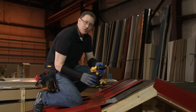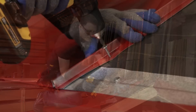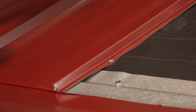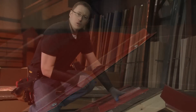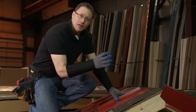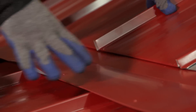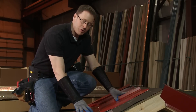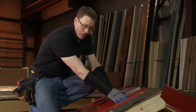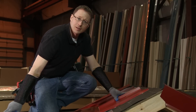I'm going to install a couple of screws and then we can install our last panel. Earlier we talked about how water hits the upper panel, flows down across the transition trim, and onto the lower panel, exiting the roof at the eave. And that's exactly what we've done here — water coming off this panel, coming across and over, down the roof, and out.